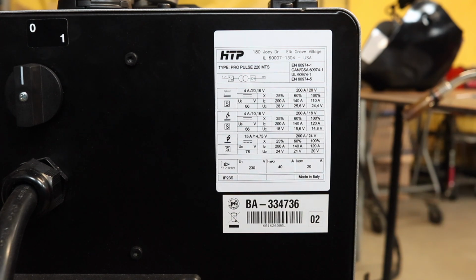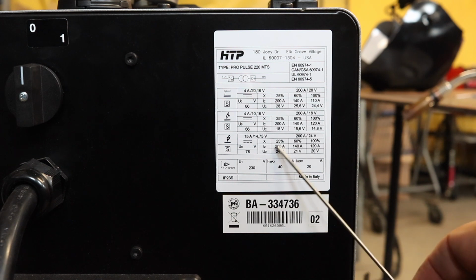Now, this is at 104 Fahrenheit air going in to cool components that cannot exceed 140 or 150 degrees Fahrenheit. So when you look at duty cycle in all reality, like in real life, unless you live in Florida, Texas, New Mexico, Arizona, Louisiana, Mississippi, very rarely in real life do you encounter situations where the ambient air going into the machine exceeds 100 degrees Fahrenheit. Now, if you live in Minnesota, North Dakota, Maine, Wyoming, and it's winter and your shop is barely heated to like 50 or 55 degrees, and you pump 55 degree air in and it needs to cool components that cannot exceed 140, that's way more efficient than pumping 104 degree air in. So now your numbers here go way up.